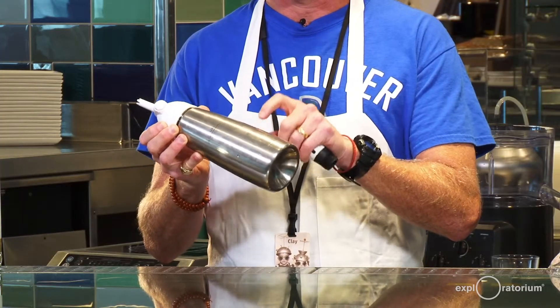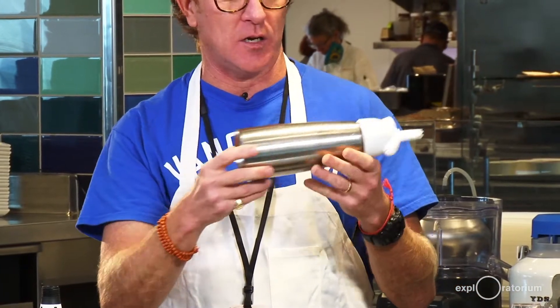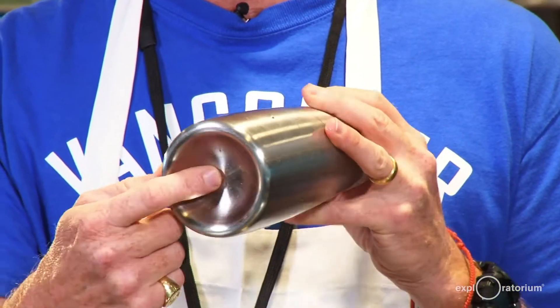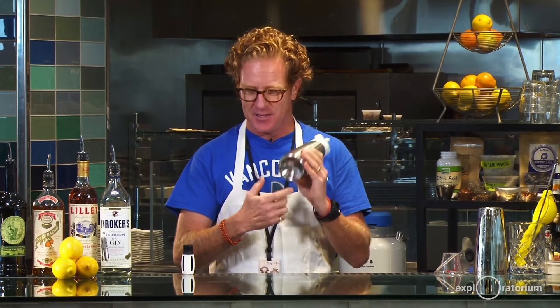This is really the most effective and safest method because this vessel is solid. An important thing when buying one of these: get one that has this indentation on the bottom of the canister. This is a fail-safe — if you over-pressurize it, this will pop out before the canister does. It's a safety measure, so any brand will work as long as it has this feature.